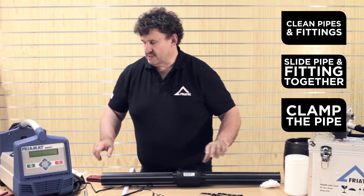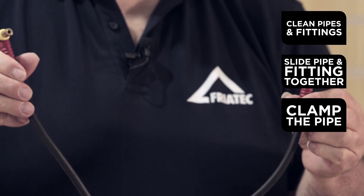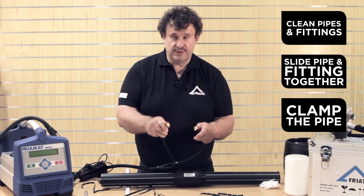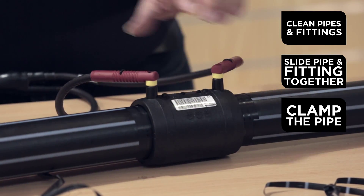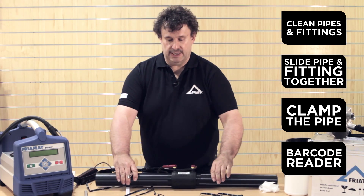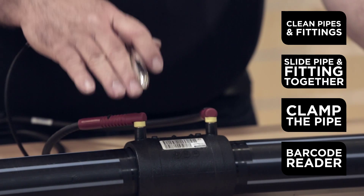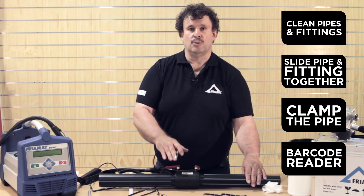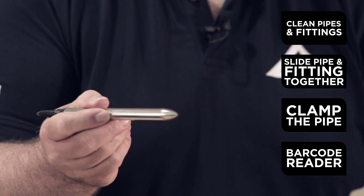All three marked boxes are equipped with 4-millimeter connectors, but they are also available up to 4.7 millimeters to handle competitor fittings. We connect them — direction doesn't matter — directly to the fitting. We have the possibility here for a barcode reader, and with this barcode reader we bring all the necessary information into the box. The barcode is related to ISO standard, which makes sure that our box can handle competitor fittings, and likewise our fittings can be welded with competitor boxes equipped with a barcode reader.